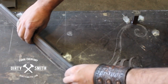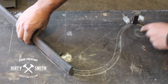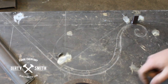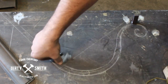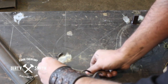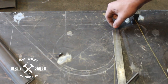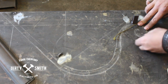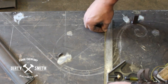Doing these I want everything to be proportional - if this thickness stayed the same, obviously the tip we don't want to stay the same either. You can get these travelers off eBay or antique stores, or string is fine. I wanted to find out from this point to where I thought the taper should start - how long is that distance? You simply take a piece of string, go centerline and come back to it. We're pretty close to 12 inches, and using the piece of string, we get an idea about how long the taper needs to be - in this case right around 10 inches for the taper.